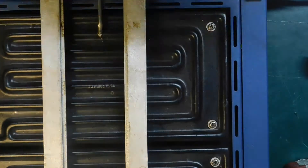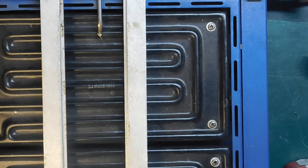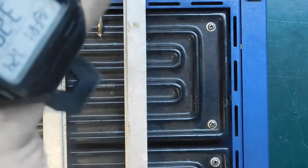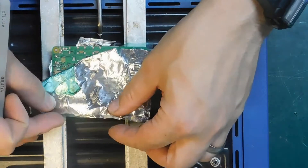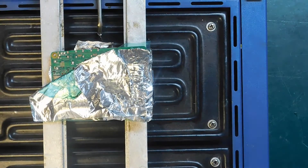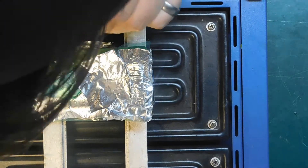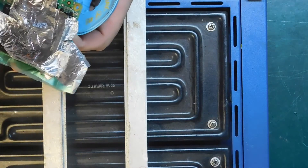Suck out the pads quickly. I thought I might have two power points so I'll have to turn it off for a second. Now I'm going to just wick those holes out just so the new connector can sit flat in there.